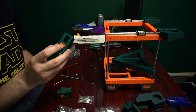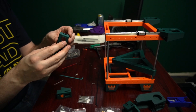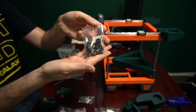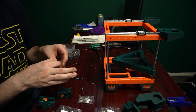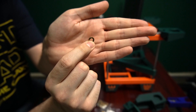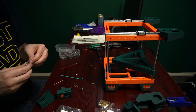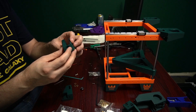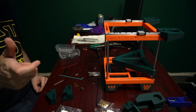Again, I appreciate all the patrons — you definitely helped me purchase that camera. MK 1.1 idler mounts: I've also made these a little bit easier to print with a much flatter surface on the side that sits on the build plate, just a little bit simpler to print. These are going to be mounting like this. We need to take our F695 bearings included in the Fabrico kit, and we're going to be using three of these precision M5 shims also included in the kit. I like to assemble these upside down so you can get the mounts in place correctly. I'll put an M5 bolt in here as I'm stacking the bearings on top.